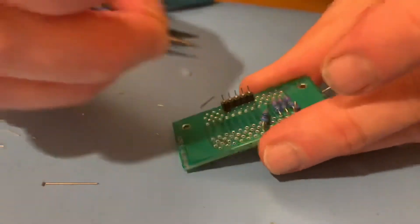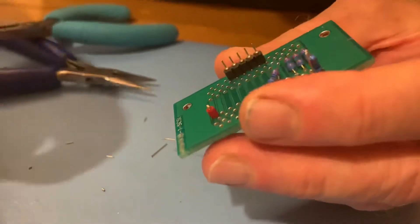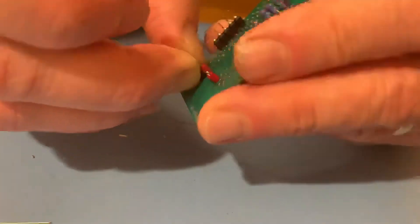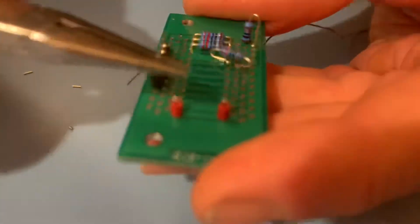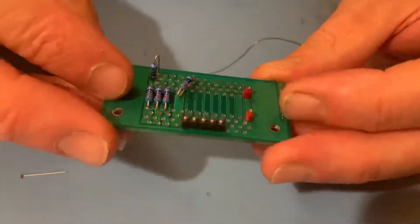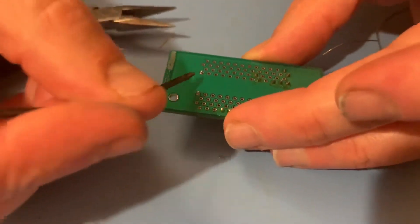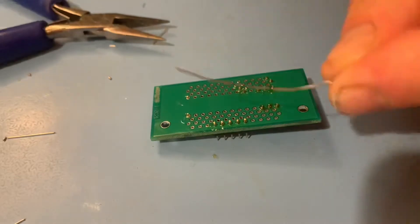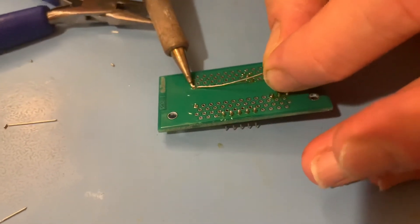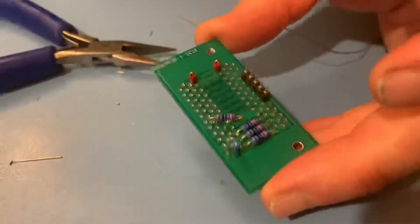There you go — five nice joints, not too bulbous. You're not looking for bulbous joints. Now I'll quickly put a couple of test points in. When I do these I look for conformality as well. Pop one in there, pop one in there. I always like these to be orientated the same way — both loops directly across. It's not a problem if they're not, but I just like things neat. Just a little bit of solder, two or three seconds each.